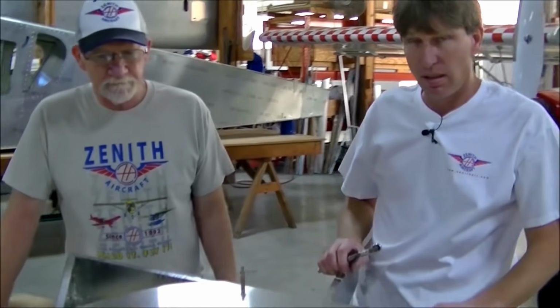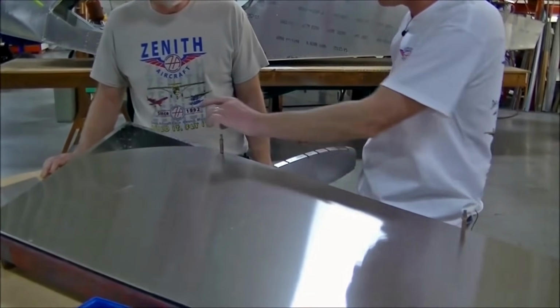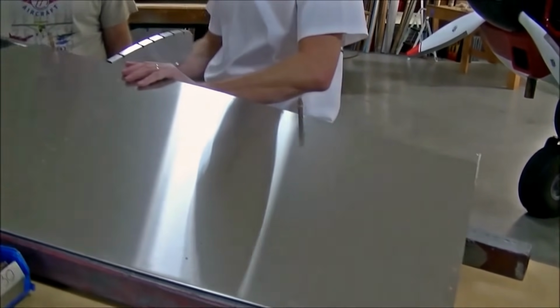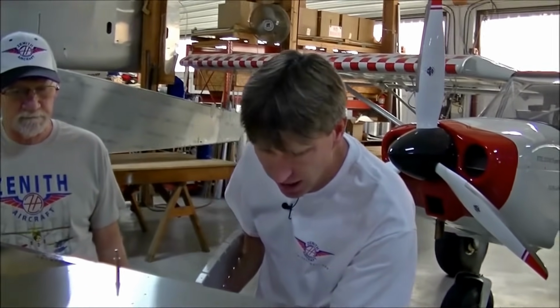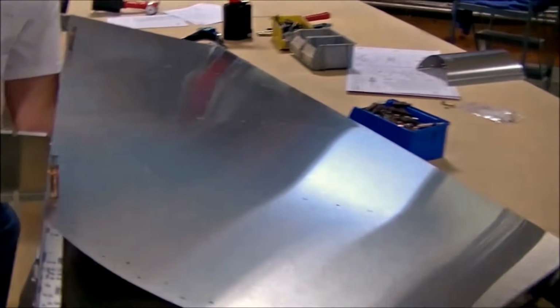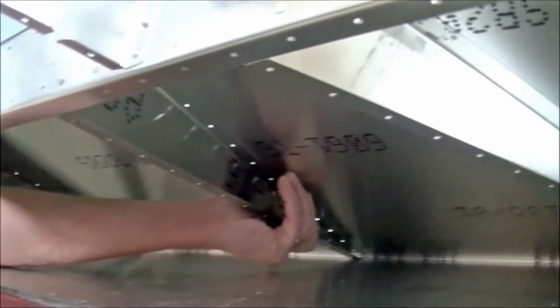That makes sense. And I've added a couple of clecos on the spar, but the nose skin is going to go over and rivet, so we do not want to rivet the nose or the spar at this time. We'll lift it up, put my hand underneath the skeleton, and I can move the rib to locate the holes in the rib. See if you all can see this here at home. So I've lifted up the skeleton, the section. I can move the rib to locate the holes.